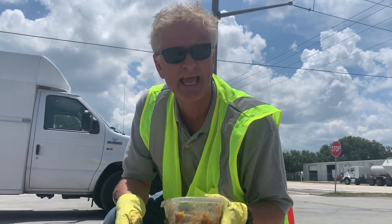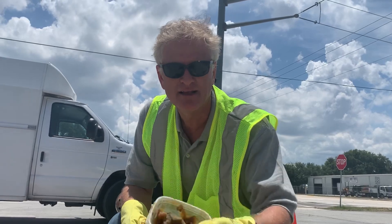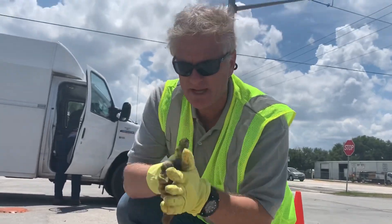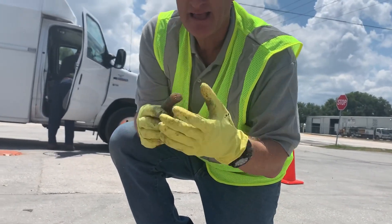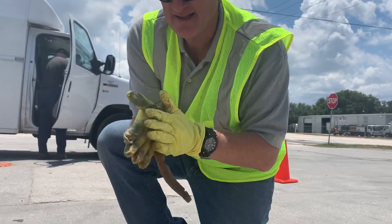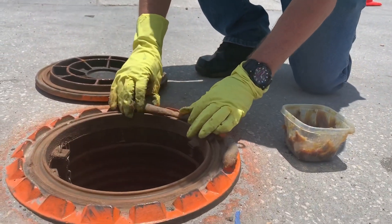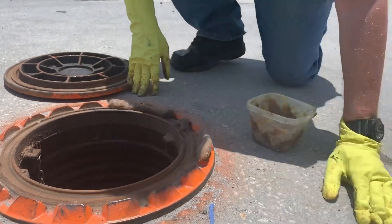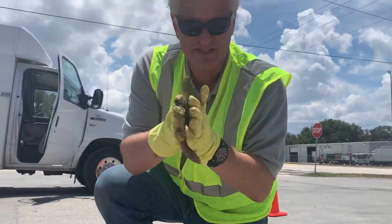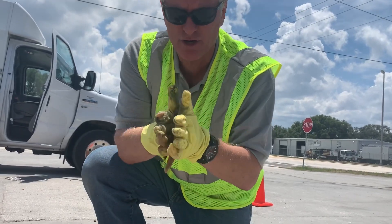For the next exercise I'm going to show you how to apply the Steel Camel Dough. This is industrial cookie dough with water blocking gel in it — comes in a container, usually about a pound. You take a chunk out and roll it up like a piece of licorice, getting a consistency like a big spaghetti noodle. Put it right in there. You'll definitely need gloves — it's a little tacky. A lot of people like this one because it's tackier, stays in place a little longer.